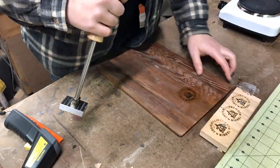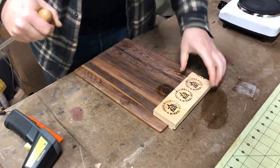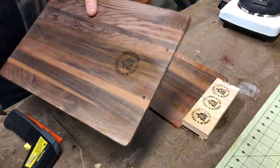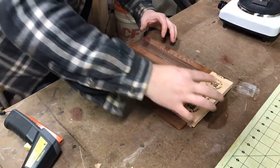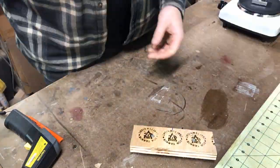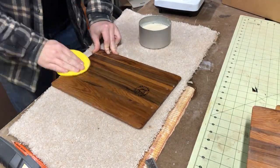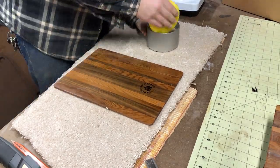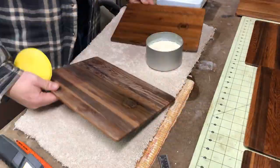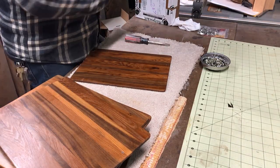I made a little jig with a center line on my stamp and on the jig so I can just brand my logo on all of them in the exact same spot. It's just a piece of plywood with a right-angle board on it and two nails through it that line up with the clipboard holes. Then I finished each of them with some paste wax on both sides — the Tree Wax paste wax. The Johnson stuff works really good, I just don't like the way it smells.